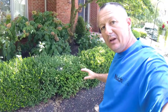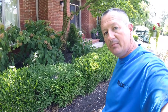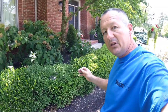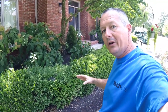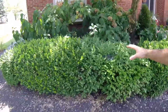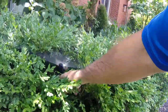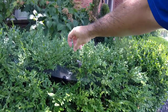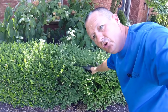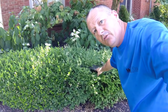So you have two options. You can either install a plastic riser that stays on top of the pop-up spray head all the time, but those are kind of fragile and as things get jostled around during hedge trimming they have a tendency to get broken off. The plastic risers look just like this — you would just remove the top nozzle and screw it on the top, then replace your nozzle on the top. It's pretty easy to do, but it's not a very sturdy repair. So we're gonna look at doing this a different way.